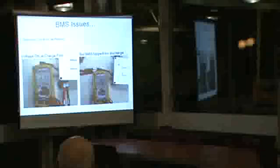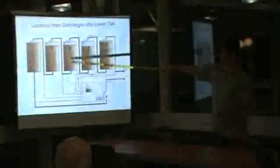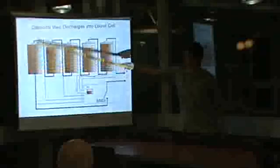One big danger about this situation is that we have all of these wires connecting the cells to the circuit board. Now, we put fuses on the output wires, so if you short circuit, you're fine. But we now have this huge collection of thin wires scattered throughout the pack, coming to a common board, and nothing's protecting these together. So if you were to mash the battery or get into an accident, you could cause a short between these wires, and then you're directly short-circuiting these cells, again, without any fusing or anything in the circuitry to shut that off.